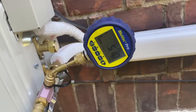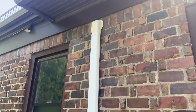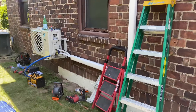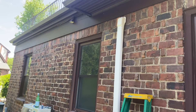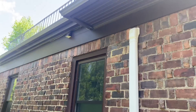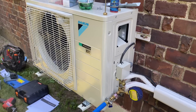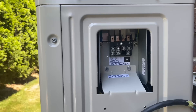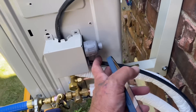Almost 11:50, 51 microns — the Daikin is almost installed completely. I'm using white line hide — the homeowner didn't care if we used brown or white and didn't want to pay extra for the brown. They said no one's on this side of the house anyway. So there's the 100 millimeter white: I got the wall outlet, a flat 90, another piece, and I have my minimum line set distance perfect. The Daikin 12,000 BTU R32 inverter looks beautiful. I love the electrical components — L1, L2, ground, and one, two, and three. Really nice and easy.